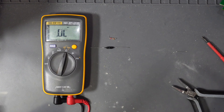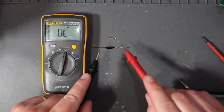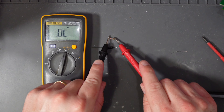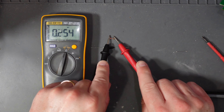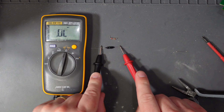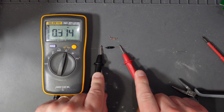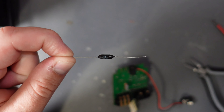The main thing that Joyo did wrong when they were cloning this pedal is that this diode here, labeled D2, is a germanium diode and it's actually been put in the wrong way around. The silkscreen on the PCB is actually wrong. So I suggest clipping it out and then putting it back in from this side but flipping it over 180 degrees. I'm going to check if I've got a replacement diode rather than trying to save this one, because they're a bit of a pain to get out in one piece.